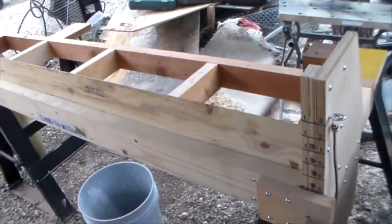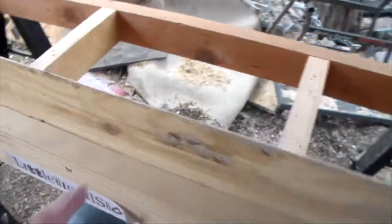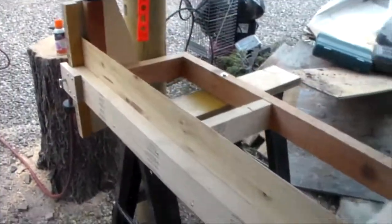Okay, the plexiglass pieces have set up. Slid the guide back in, and right there is one, it took that gap up perfect. There's the second one in there, third one, fourth one, took the gap up perfect and really eliminated that play there. So I think with that angle iron now on here, might really have done the trick. And it still slides up and down okay, so far so good.